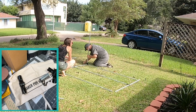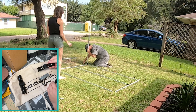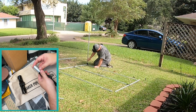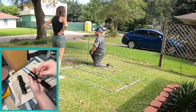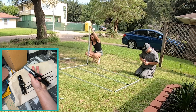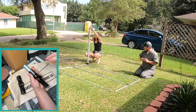During the build montage, I'll tell you a little about these maker pipe connectors. All the connectors are steel construction with a corrosion-resistant coating. Combined with the galvanized pipe, this makes for a very durable connection. The hardware consists of a bolt with a five-millimeter hex head and a nut, and the back side of each connector has a groove that holds the nut in place so you don't need a wrench when tightening. I'm just using a T-handle five-millimeter wrench, turning the bolt into the friction-fitted nut.